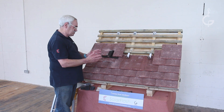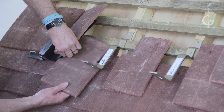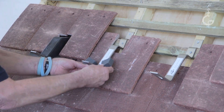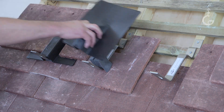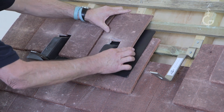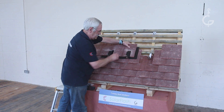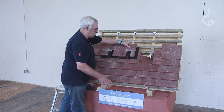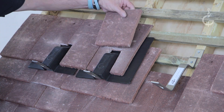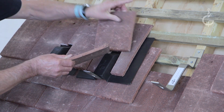Position B — it's two under and one over. Foam on. Solar flash on. Now this one over, even though it's as flimsy as the other one, if it broke off the roof is still held tight — it would come down the roof. But you could leave it on; it leaves a better-looking job. If you wanted to, you could just use that, or you could put a piece of tile behind it. The only difference is you could see some extra solar flash, but it's still going to be waterproof.